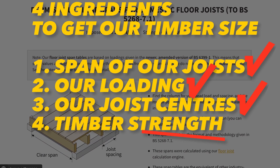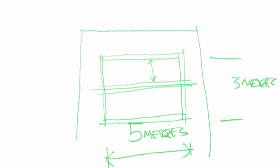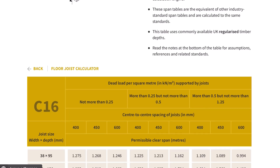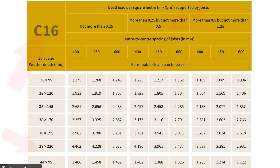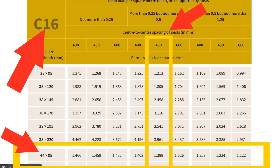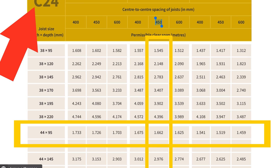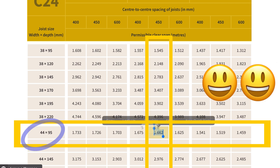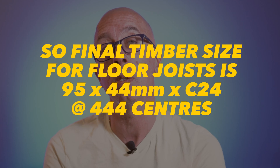Onto our strength: timber is graded into strength classes called C16 or C24. They both look the same, but C24 will span a bit further and costs a little bit more as a result. From our plan, our maximum floor span is 3 metres divided by 2, so 1500 millimetres, and then minus 45 millimetres for our central spine — so that gives us 1455 millimetres as our span. If we look at the chart, C16 just isn't enough this time as we only get 1388 millimetres. We see that 95 by 44 by C24 gives 1662 millimetres, and this is the smallest size we can get away with using these timber dimensions. By all means use a deeper size, which could mean you won't need the central supports, but our aim here is to use as small a section as possible as our starting point in order to keep our overall height down.